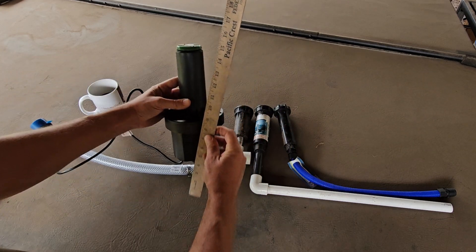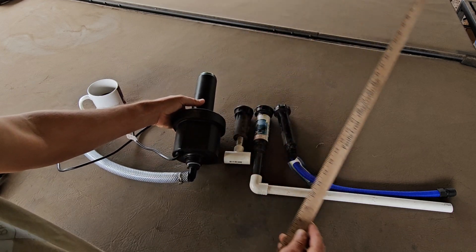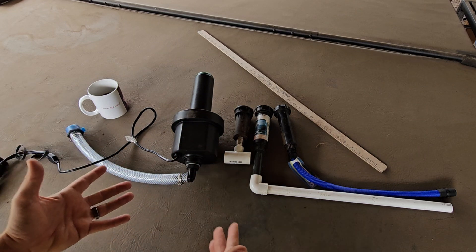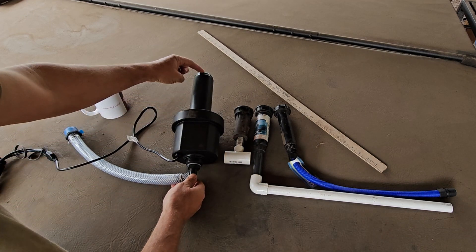This head, top to bottom, is about 13.5 inches, which means if I'm hand-trenching this into the ground, I've got to have the trench around 14 inches at minimum for the pipe to connect to the hose and for this not to be sitting above the ground.